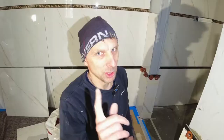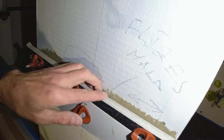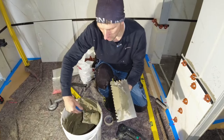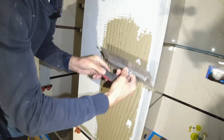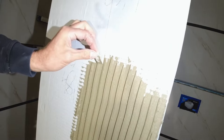Glue and masking tape. The masking tape helps out if we need to have a transfer not from tile to tile, but from tile onto something else. We have to protect the edge of the tile, so we put a piece of masking tape on the wall, apply some glue like that, and then we remove the masking tape and you can see the line where the tile should be.